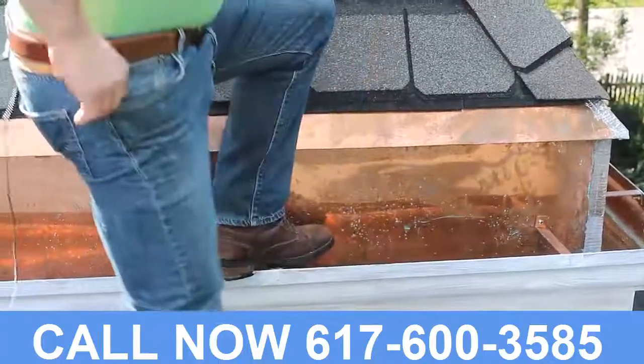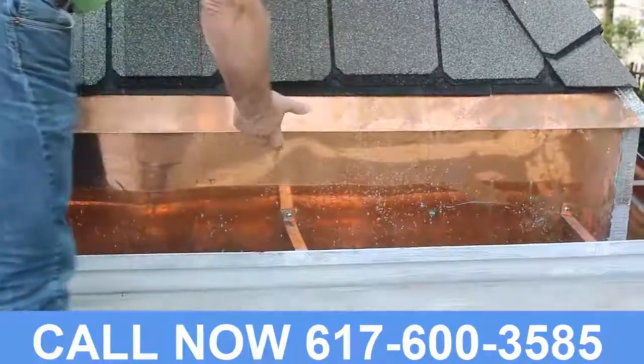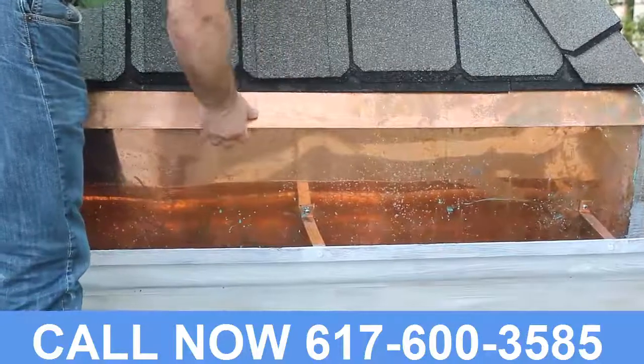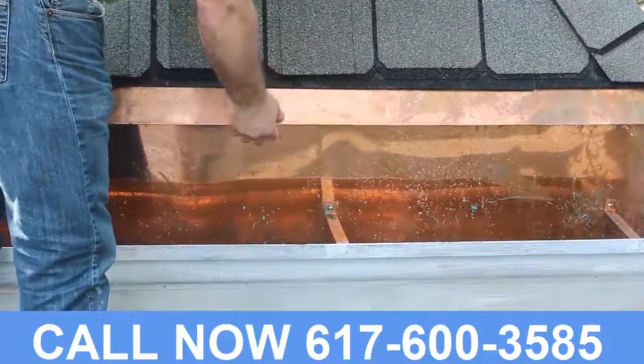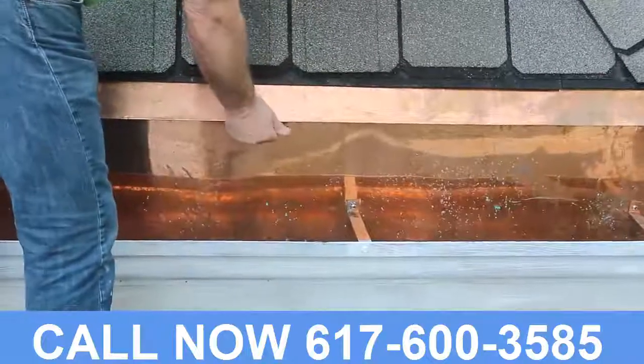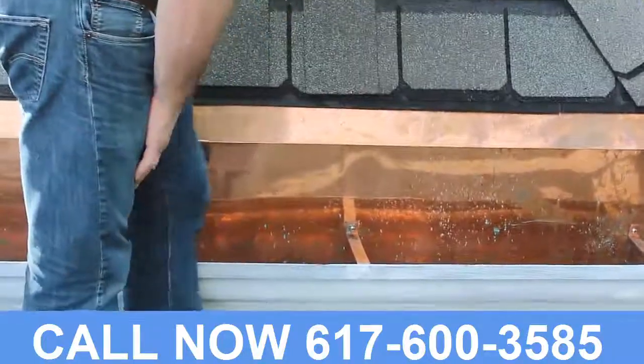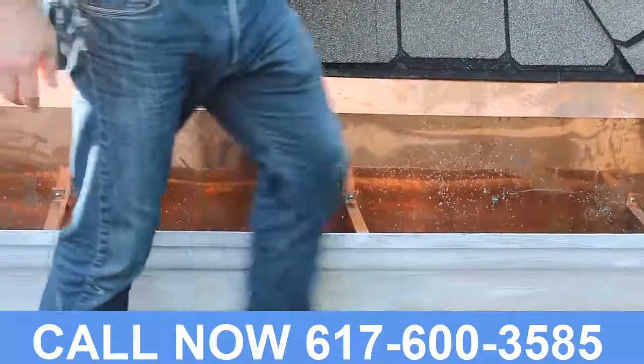Note the high back of the gutter. This second piece is a custom molded copper gutter, and the secondary piece is a roof flange that attaches to the gutter, forming both a drip edge and a roof flange — tucking way up underneath the shingles, in this case about 12 inches.